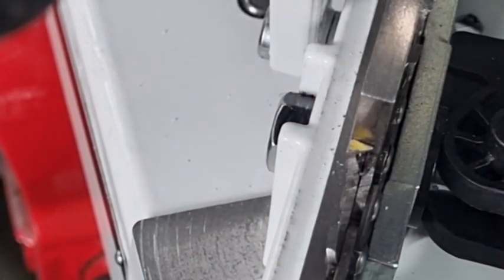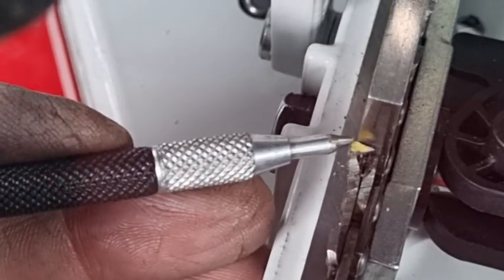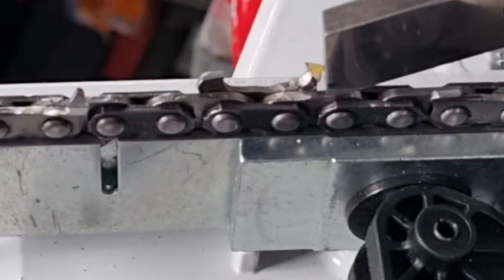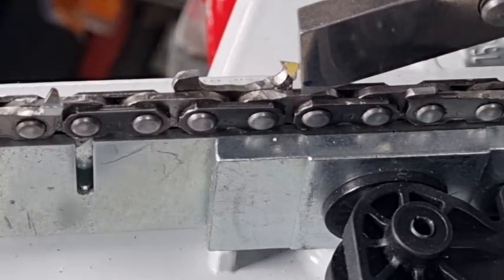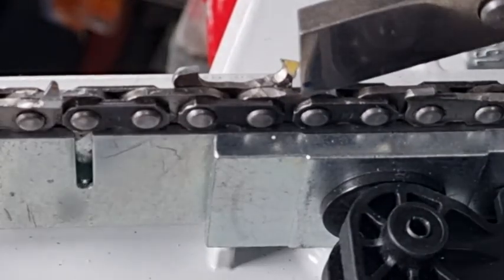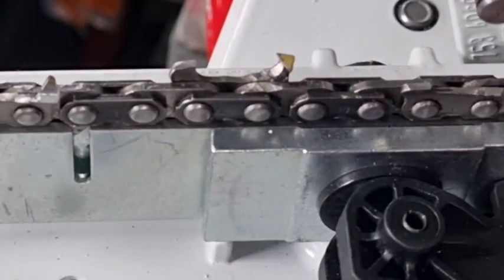You can see that the tooth is on a slight taper, meaning the point of contact is over this side, not this side. So having this five millimeters in width is absolutely useless, because if you look here, you'll clearly see that having it five millimeters wide serves no purpose — it's only touching on the far side. Now all chains are different; if I put another chain on there it's liable to sit in a different position. But clearly you don't need it to be five millimeters wide — anywhere from 4.1 to 4.3 is pretty good, and that's what I've made mine: around 4.3.